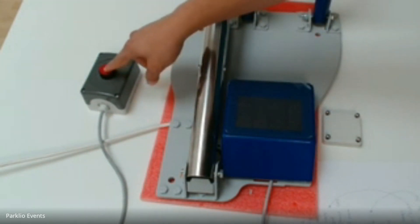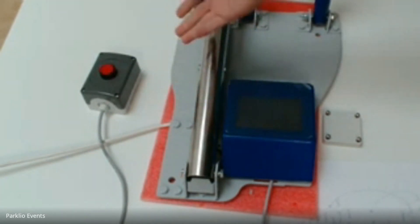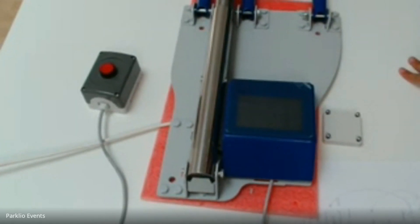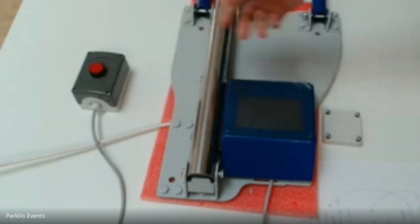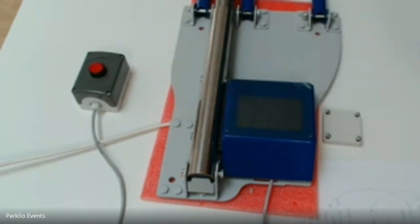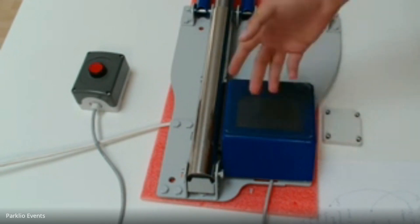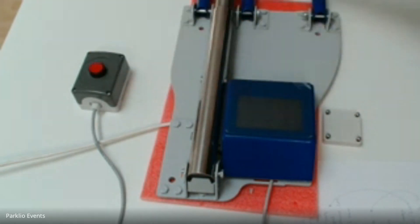On a press, if I press the button, it will basically short the wires and give a command to the barrier, so the barrier will lower — no Bluetooth needed. This is a nice way to speed up integration with systems that don't want to use gateways or Bluetooth; they just need a simple IO interface. Every press will lower and raise the barrier — it will toggle. Also, it is possible to hook one button up to multiple barriers. So if you want, for example, an emergency feature for fire escapes, you can hook up all the barriers in parallel, and on a press of the button, all barriers will lower.